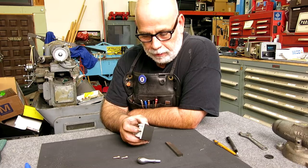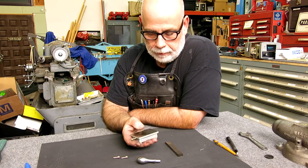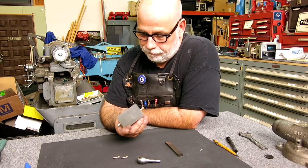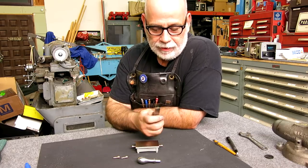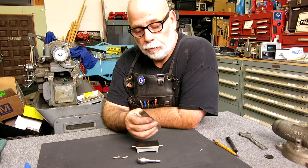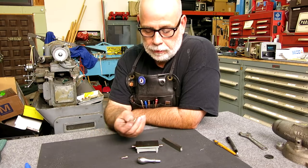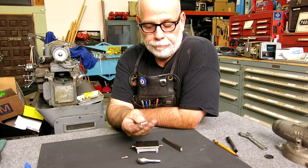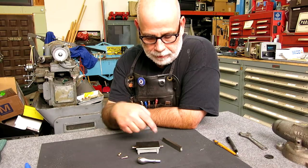So I made some little handles that go in here and some little bushings, and I'll eventually scrape the top of that and then put it on the shelf. Anyway, this is a great application of a form tool. This one's high-speed steel and it was ground to produce the form for these little handles here. So let's take a closer look at this and then we'll go make one.